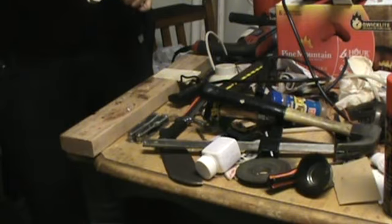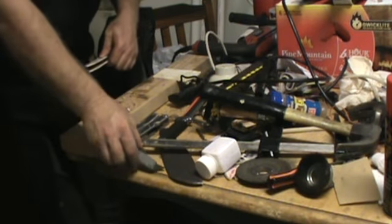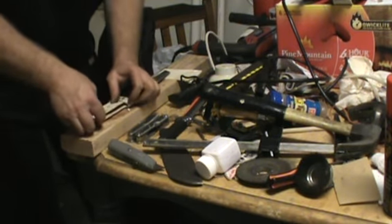Now watch this, I'll clean them out. Then that'll lay down. I got it in my glue and I didn't want that, but I should have drilled it before I glued it, I guess, but I thought it was glued down and sealed. I should have let it dry first and I didn't. Getting in a hurry, see? You either let the glue dry first and then drill it, or drill it before you let the glue dry. The other thing I should have done was take a punch beforehand and dot where I wanted my holes. But you can't see through that handle once you do that. That's why I was doing it this way.